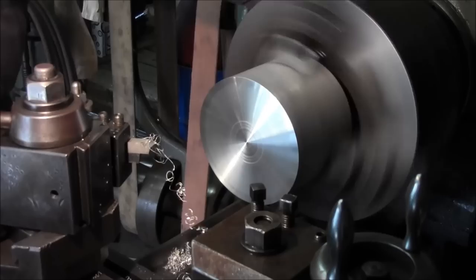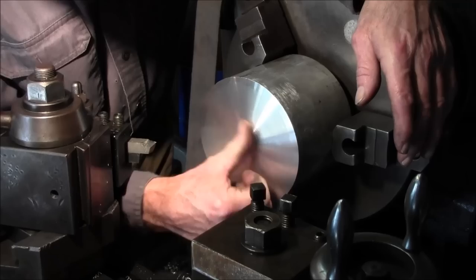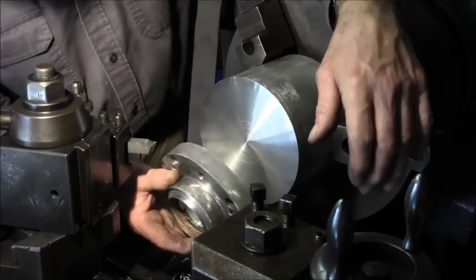Okay, for the most part, it did give me a better gloss. It had one little ring right in there that was kind of almost where the chip rolls back and kind of galls back on there. All right, but we're gonna have a bearing diameter in here. So all this area out here is pretty clean. And we're gonna be boring back on here. So really, there isn't too much of this space that's gonna be a concern.